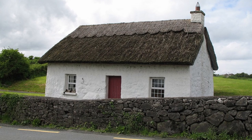To wrap this experiment up: if you're going to have a crack at thatching your own roof, make sure the roof is flat and doesn't have any valleys, because that makes it considerably harder. If I were doing it again on a small building with something like a dormer window, I'd use the traditional cheat and put another material in the valley. But I'd do everything I could to just have a straight flat roof — even with a basic amount of practice, I reckon you can do that. So yeah, that concludes the reed experiment — or at least my first one.